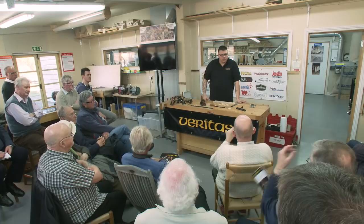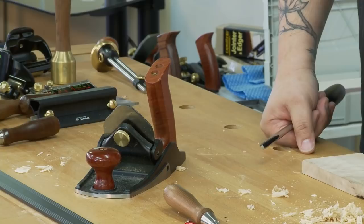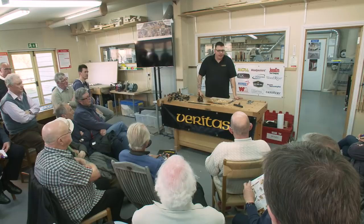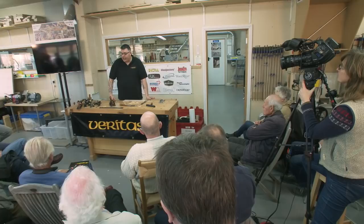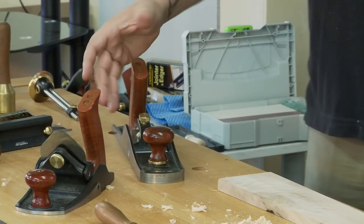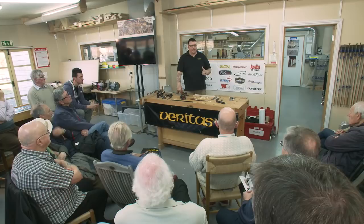Some people put a burr on the thick blade but I typically don't, because I find it's too aggressive — it'll be like a hair-shaving fingernail-sharp blade rather than a card-scraper situation. I'm always trying to hand plane with the lowest possible angle I can. If I put a 25-degree blade in my jointer or jack plane and get tear-out, I'll switch to a higher angle — maybe 35, then 40 — and if I'm still getting tear-out I'll go to a 50-degree blade. If that still doesn't work, that's when I switch to the scraping plane.